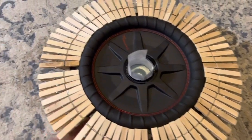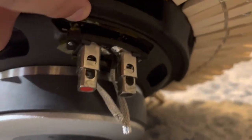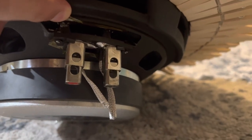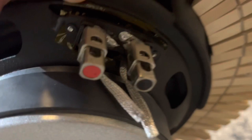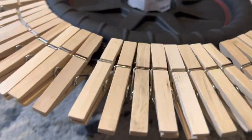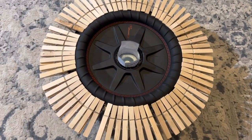I'll also show here how we did the tinsel leads. The tinsel leads are run right under the spring terminals. I haven't soldered them just yet, but they'll be soldered onto those two little points right there. I've got some heat shrink around where it goes through the frame, that way we prevent any shorting or potential of shorting.